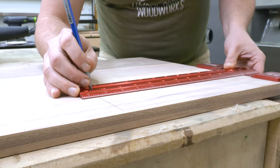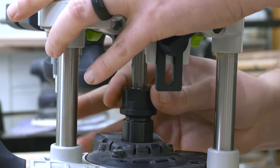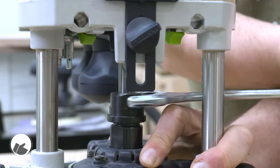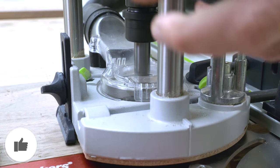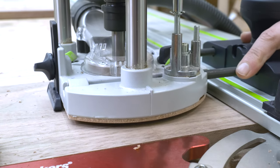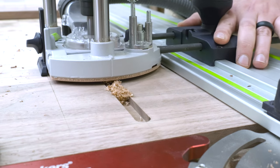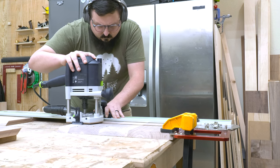Now that we have all the miters cut for our box with that nice flowing grain pattern, I can use my router to cut in a few stop dados so we can install that lower shelf which will hold our drawer box. To cut the dados I'll use a half inch down cut bit and set the depth of cut to a quarter inch. I'm using a guide rail to hold the router straight during the cut, and I like to start by plunging at my stop and then working the bit towards the back side of the workpiece — this way I exit the cut in an area that will get covered up later. I also like to cut the dado prior to the tenon so I can test fit the tenon and get it just right.